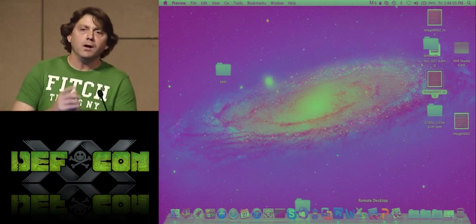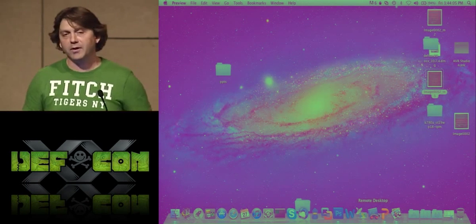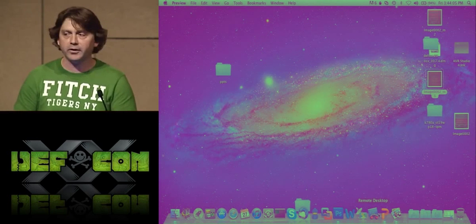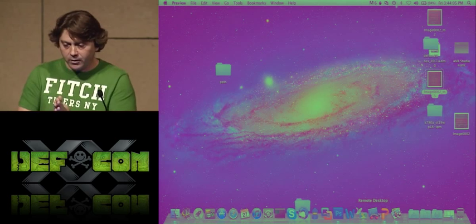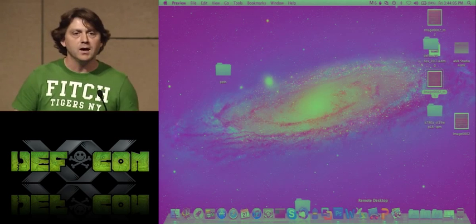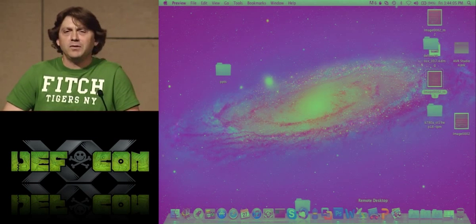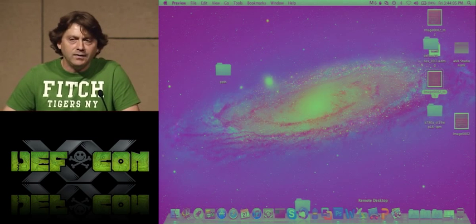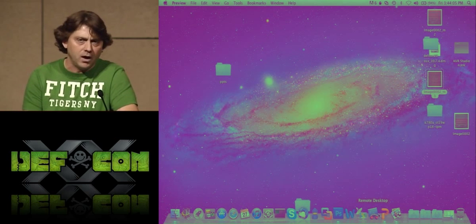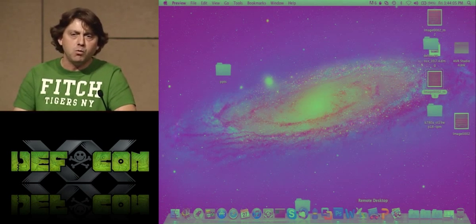Okay. So once I'm finished and I've extracted an image, which is the EEPROM area of a particular chip, the gentleman wants to know what's the time to do another one, to kind of repeat the process. On the Infineon chips, it took me 6 hours. On the ST, it would be significantly less because of their concept. Their shielding is the weakest in the market.